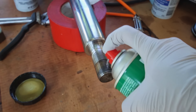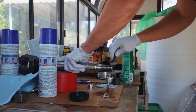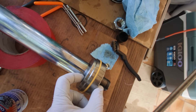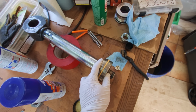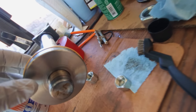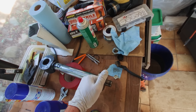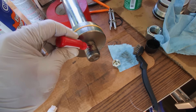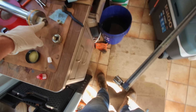Clean the threads — get all the oil and grease and grime and dirt off the threads. When the blade goes down, the cylinder extends and the piston head pushes against here, sealing against that. But when you lift the blade up, because the nut wasn't tight, it would pull the piston back a tiny bit. Then fluid would slowly leak through the threads through the hole into the other half of the cylinder. That's why the blade was sealed when you pushed up on it but leaking when you push down on it. Loctite. New nut. But now we've got to torque that to a thousand foot pounds.